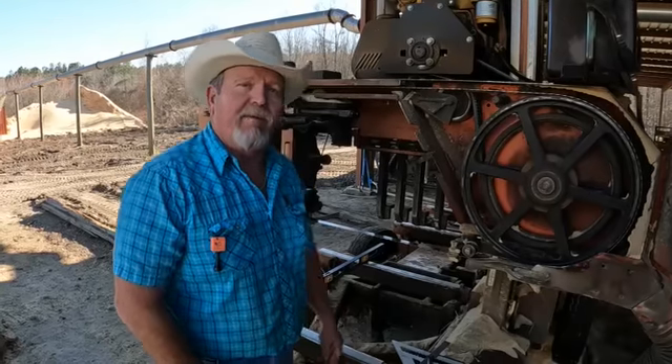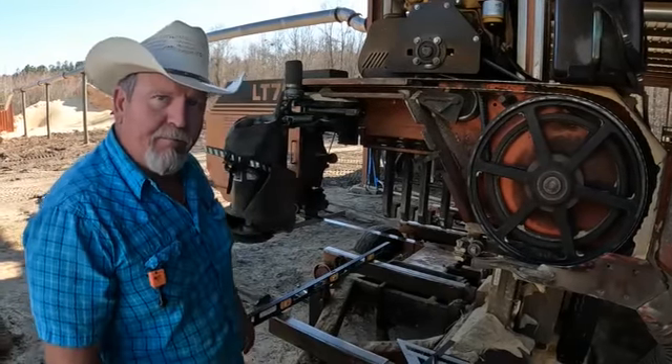I don't stress over the high-performance blade guides personally. I feel like if I've got an alignment problem, it's going to be before or after — it's either this blade guide roller or that blade guide roller, or some other form of alignment affecting the blade. If those blade guide rollers are right, that blade in my opinion should never touch the high-performance blade guide. So as long as you've got everything dialed in, these are nice to have — a little extra security. But if I ever start touching them, we're going to find out what the problem is and fix it, because I'll start producing poor quality lumber that'll just go to the trash pile.